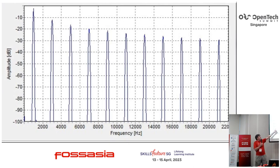This is approximately a square wave. Let me give you an example, here. The fundamental is about 3 dB below what's expected. The third harmonic is only 10 dB below it. Even in the simplest of regulatory cases, the worst permissible point here is 43 dB, or 20,000-fold, below the carrier. So if this were an actual radio, this is 1,000 times over the simplest possible compliance case. And actually, under various circumstances, the compliance requirements get tighter. So you don't ever want to work on it.